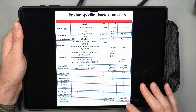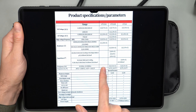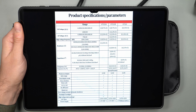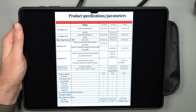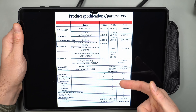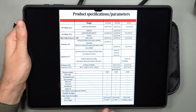The UT-122 is also the only one with a built-in rechargeable battery; the other two use two triple-A batteries. The A model doesn't do resistance, capacitance, frequency, or temperature, but the B model does all of those and also has a diode tester, which the 122 also has. It's a little strange that the monochrome A model doesn't measure the same things as the color-screen B variant, even though they use exactly the same case.